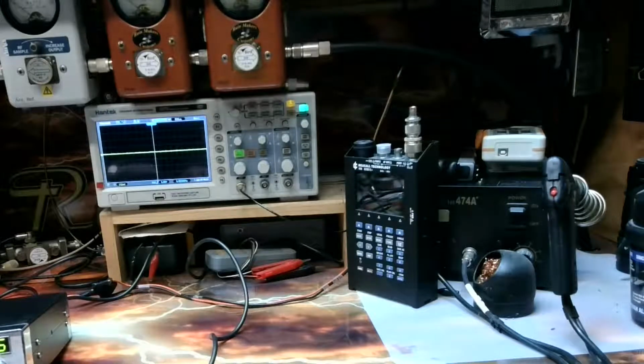It's going to be a fine mix that has to be created between your carrier level here and the input of your injected audio. Playing with both of those, you don't have to worry too much about the compression ratio that's also involved for the symmetry. Like I said, this just uses two basic relays on the inside with another keying circuit wired into the transmit. Your talkback for your echo is still in here, so it still works. Whenever you disable this and use your stock mic, you can use your echo board again. Otherwise, you're going to rely on the effects of your input audio from your mixing board. Now, to switch between your direct inject and your microphone, bright is your direct inject, and dim means you're going back to your stock microphone.